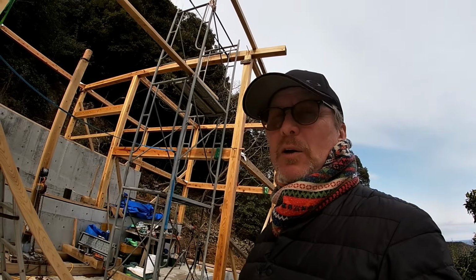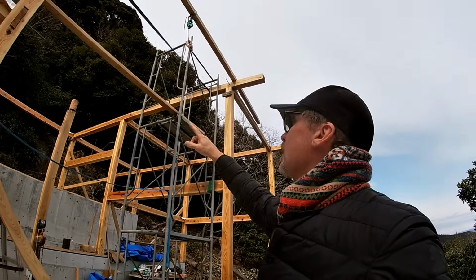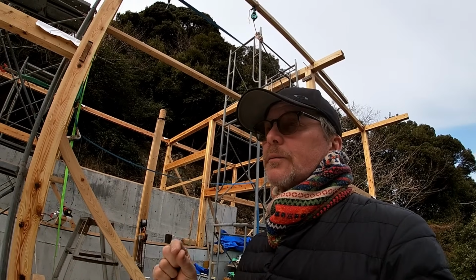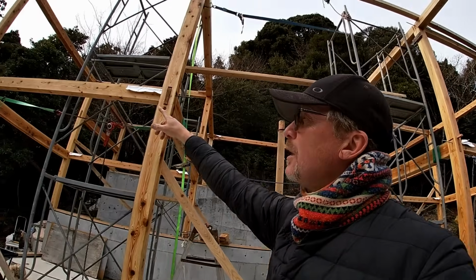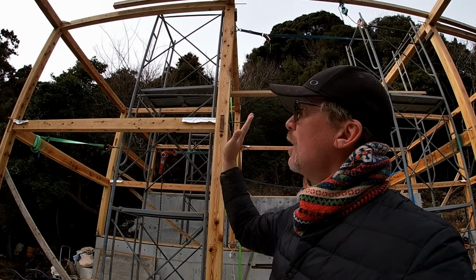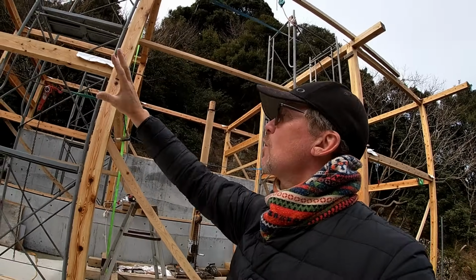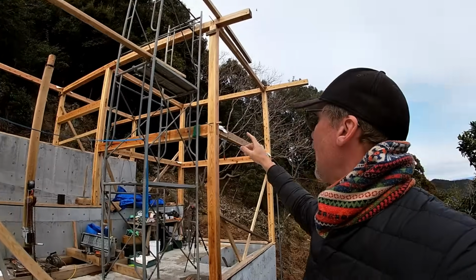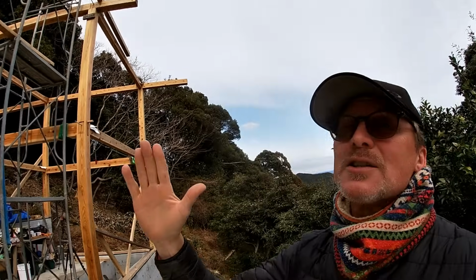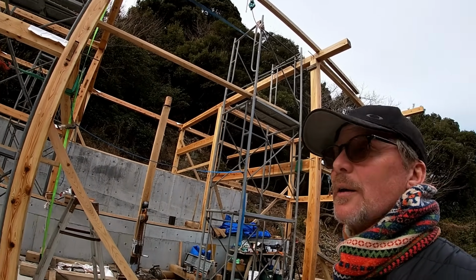Yesterday, for 4 hours, Jaime and I struggled to get one of them either in this middle part here or in the upper part. And the tolerances are really severe here. When we've had to put in the other girts, we had a lot of flexibility because nothing was really tied down. So the posts themselves, we could push them out quite easily. But now this whole structure is kind of locked in place, as is this one. And we struggled to pry this space apart enough that we could squeeze in the girt, and we failed.